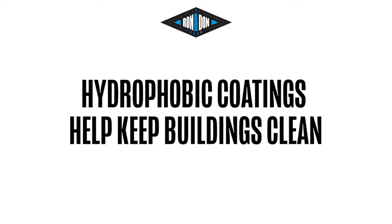And hydrophobic is the action you see on your car when you wax it. You get all the beading up. Well, you can also get that with a lot of the surface coatings that are available today from like Sto and Dryvit, where they're making these hydrophobic coatings. And as you put them on the building, they will stay cleaner because they're almost self-washing every time it rains.